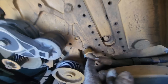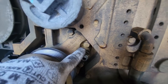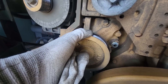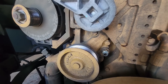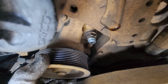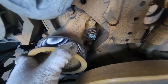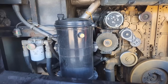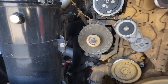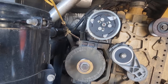Now that the hose is unthreaded from the water pump, we need to get these four bolts out — there's only four bolts that hold it on. You can see the bearing had failed in this water pump, and there's a shaft seal. Once your bearing goes out, it wipes out the shaft seal. This is a very unusual failure for a C7 or C9. Generally if they're leaking it's coming out of the weep hole, but that is not the case here. Since it's belt-driven, this does not have oil going to the water pump, unlike the gear-driven ones.